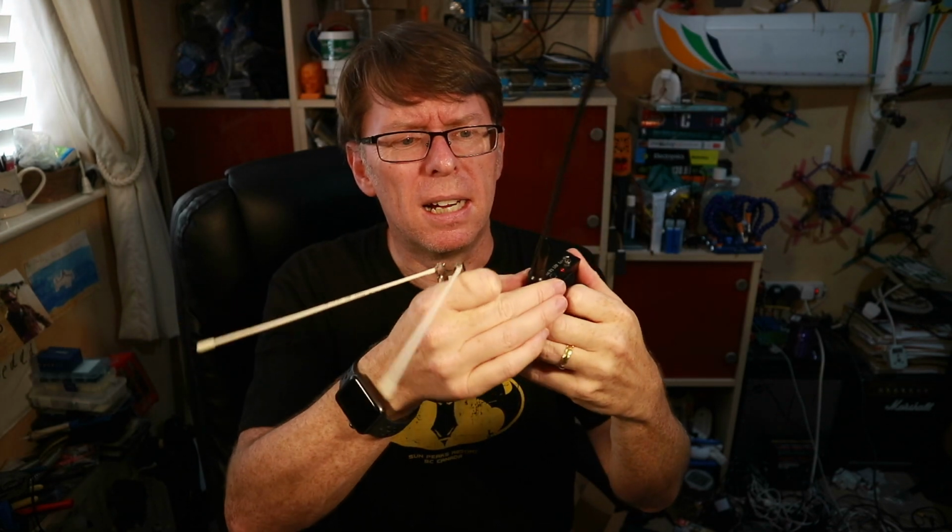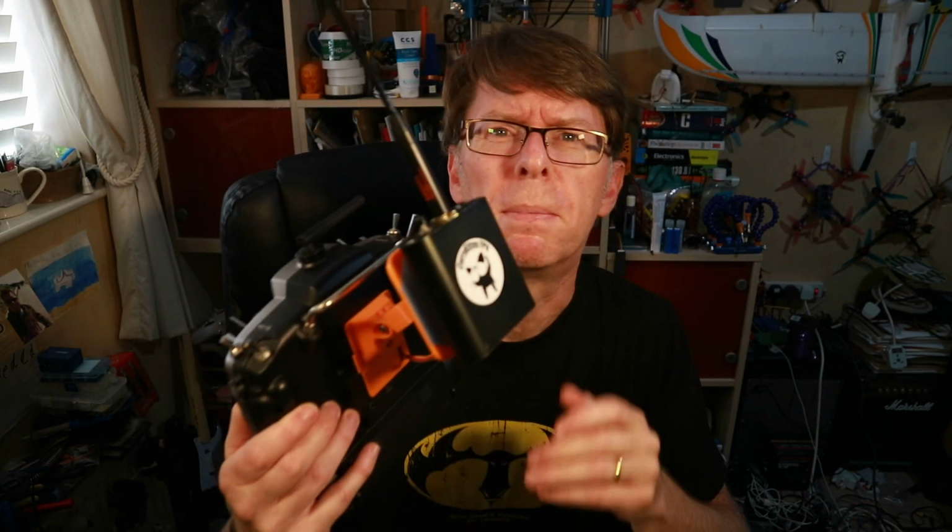But to go really far back in the olden days, you needed to go to a 433 system. I've got a couple here. This is the R-Link, this is the receiver for it, and a couple of the antennas. This is the thing you strap onto the back, and this plugs in via PPM. And this was so powerful it could suck a full battery out in about a 30-minute flight. I also used this one. This was more popular at the time. This is a Dragon Link, or a V1, and this is the diamond antenna, which is big.